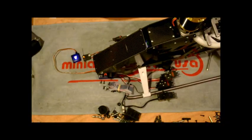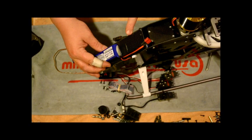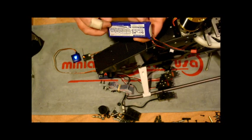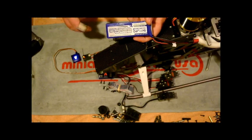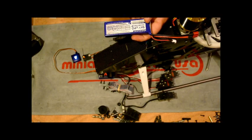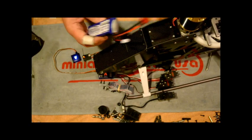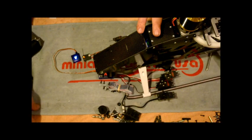I'm going to put my RX pack right here, and I've decided to go back to using a BEC Pro. So I'm going to regulate this two-cell lipo down to six volts, and then the step-down for the rudders. I like using this lipo — it's a two-cell, 7.4-volt, 2200 milliamp. With these servos, that's easily four or five flights the way I fly. These Sky lipos charge really well — I can do 3C charging on this, which is going to keep the battery topped off faster than I can keep my flight packs topped off. I have a nice portable charging rig for that.